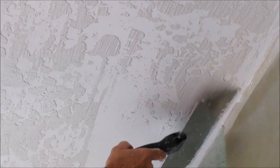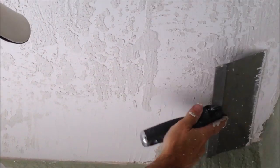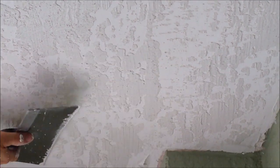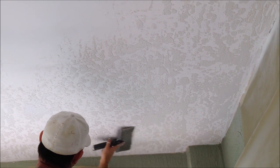It's a great Mediterranean look. I've never had anyone not like the skip trowel texture. I'm in Florida, so we have texture on everything. If you're going to try and have a ceiling and not sand it and have a smooth finish, that's not going to happen — that's the good thing about the skip trowel. And it's better than the spray textures like a knockdown texture, because you end up trying to pile it up to hide something and then when you knock it down, it just flattens out a lot differently. With this, you can add a little bit in one spot just by dabbing it and then knock it down and it blends beautifully.